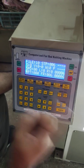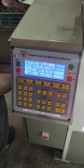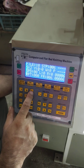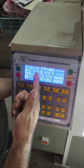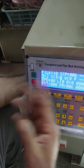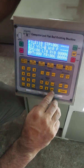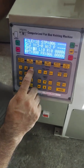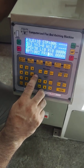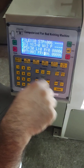After that, we put some circular fabric rounds for finishing the edge of the collar. We put stitch 2, yarn 3 — you can change that yarn; the first welt line can be one color and the second another, by changing the yarn. Winder: 2, speed: 30, with 3 repeats — the machine will move three times for this knitting.